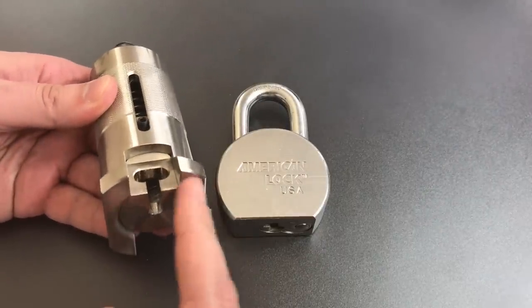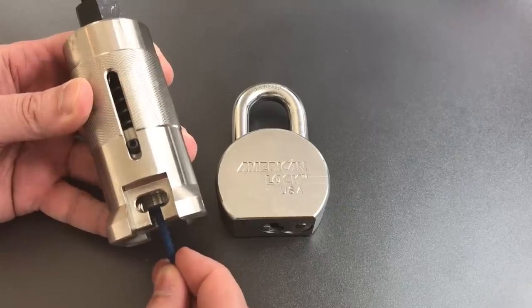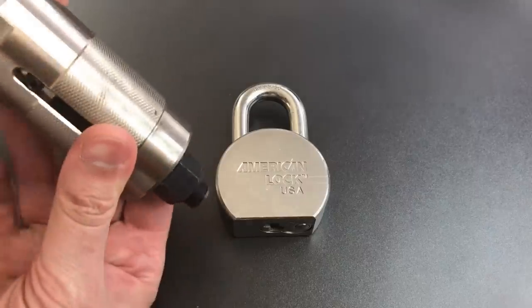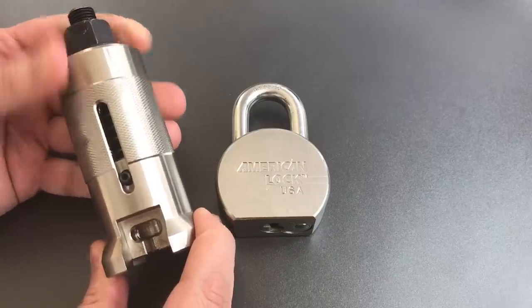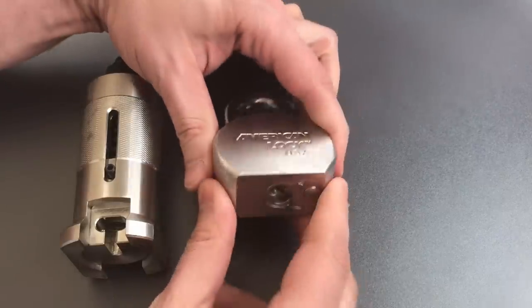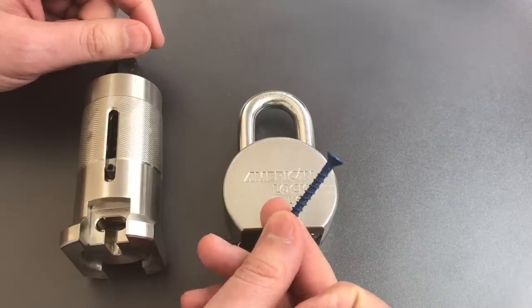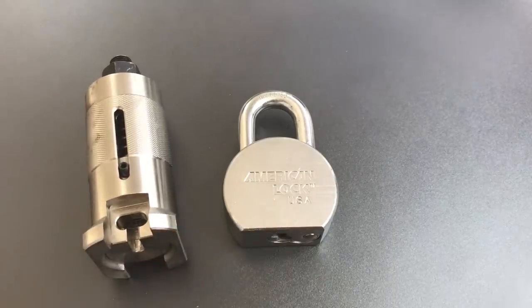It's a relatively simple tool. We have a steel tube, and in that tube is a block that has a portion machined out to hold a screw or a nut. On the back of that block is a heavy duty threaded steel rod capped off by a nut, and underneath the nut we have a thrust bearing that keeps everything operating smoothly. When you tighten this nut down, this block will retract into the tube, pull the screw with it, and hopefully anything attached to the screw. So we're going to put a screw right into the keyway of this American Lock Series 700 padlock, then attach the core puller and see if we can compromise that retention mechanism.